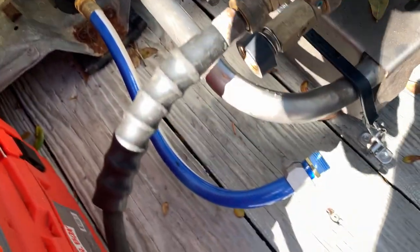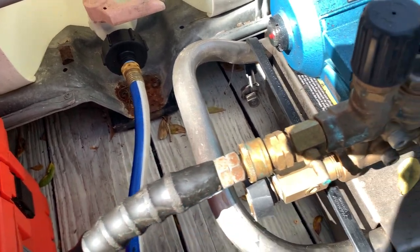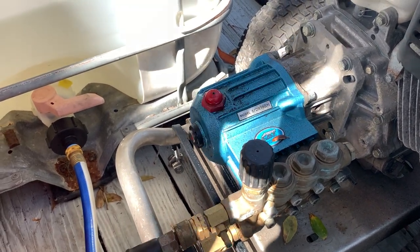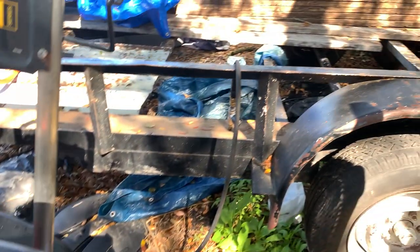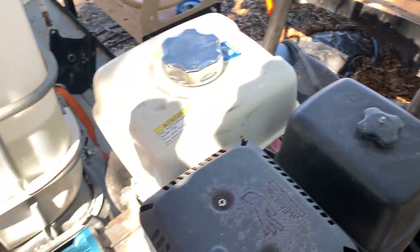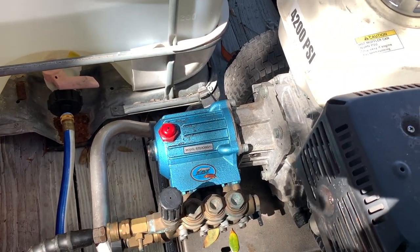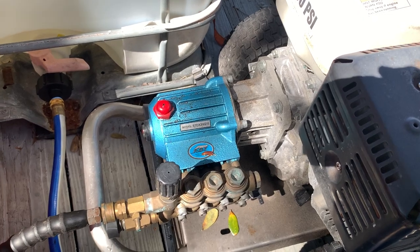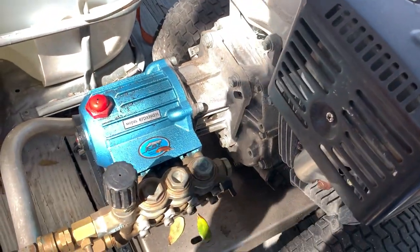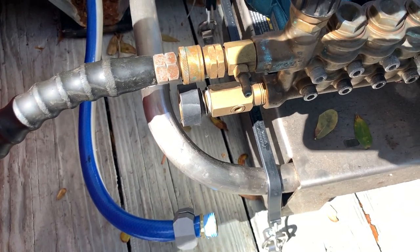When I've been just straight up connecting it like this, straight to the buffer tank, basically gravity feeding it, I've had this little thing. I do have a ball valve, right? I open up the ball valve first. I start the machine on half throttle and wait for it to suck and fill all the pressure line with water. And then after everything's filled up, there's a consistent flow on the ball valve. I pump it up to full speed, and it sucks water good.